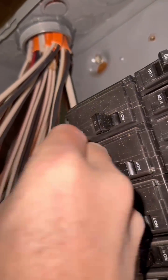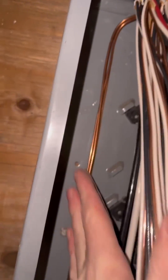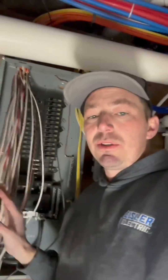I'm going to take the easiest, closest path without wrapping them around a wire. It's the art of covering up those bends with all the other wires, so it looks like at the end all you see is that last bend. I take every single ground and bend it at that same point, bring it down in a line, turn it at every single screw. On these smaller grounds — 12 gauge and below — I will double them up to save a little bit of time.